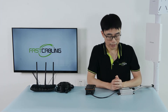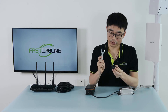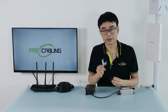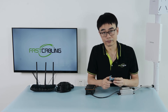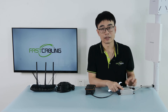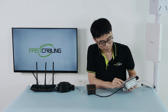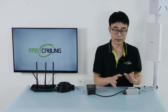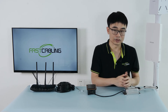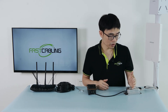There are two things which are quite important when you install this outdoor-type PoE injector. The first is the ring: when you assemble the housing, you need to use a 27mm wrench to close both sides tightly. If you don't use this wrench, it cannot achieve IP67 waterproofing — that's very critical. Don't rely on hand force alone; it's not strong enough to properly seal the housing. The second thing is the grounding spot. You can see there is a grounding spot on the body. You need to ground this spot because the device is deployed outdoors — either the power cable or the Ethernet cable could absorb surge from the environment and send it to the PoE injector. If you have grounded this spot properly, the surge will be released to ground, protecting not only the PoE injector but also your device.